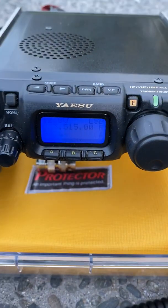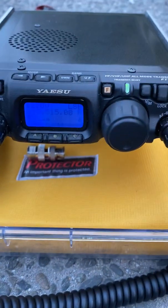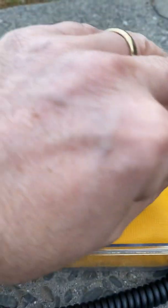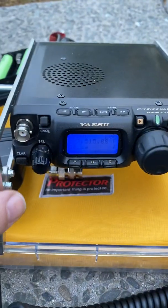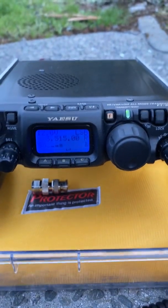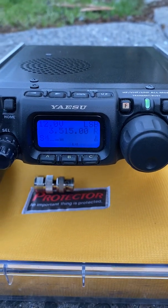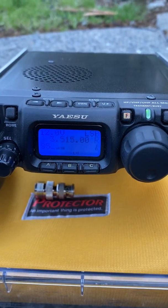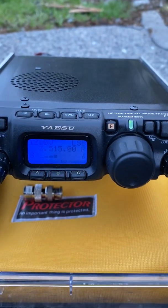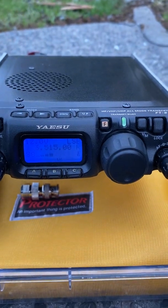You can see the LC SWR and we're receiving at about a rather horrible S4. I'd need to transmit to get the SWR meter to perk up, and I don't want to do that in that portion of the band because that'll upset the CW fellows. So we're not going to do that, but you get the drift - it tuned really straightforwardly without any major problems at all.